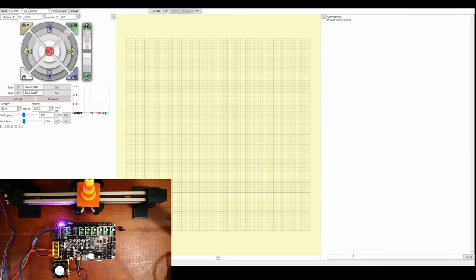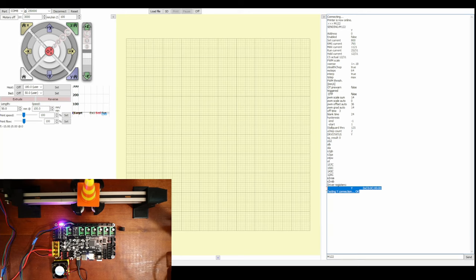Let's test the G-code by typing M122 and pressing Enter. It says OK. If it says 'low', it generally means direct power is not connected and you may be on USB only. Now let's test the Y-axis: clicking moves it one way and clicking again moves it back. Testing sensorless homing: it homes in the opposite direction I chose, but it detected the end safely — you can reverse it in firmware or flip the DuPont connector.